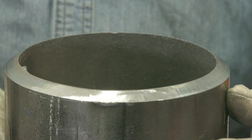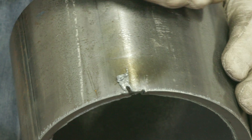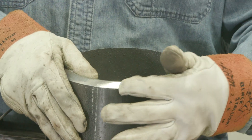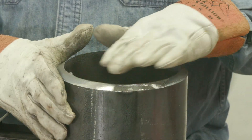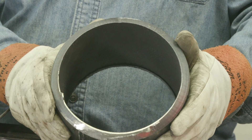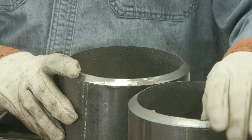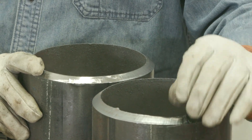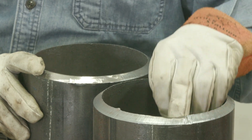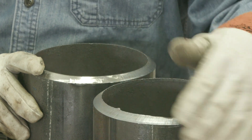I'm done with this coupon — it doesn't take very long. Right here is the weld area because I haven't done anything to the outside to remove mill scale or pipe coating. That is the repair area from the start and stop. I built it up a little bit, came back, put the root face on, and we'd clean the rest of the coupon up. It's looking pretty nice. Now we'll get into the one that's really dinged up from a hammer blow or something. We'll clean this start and stop up, clean the burr off the inside, build this up, and come back and redress it like it never happened.